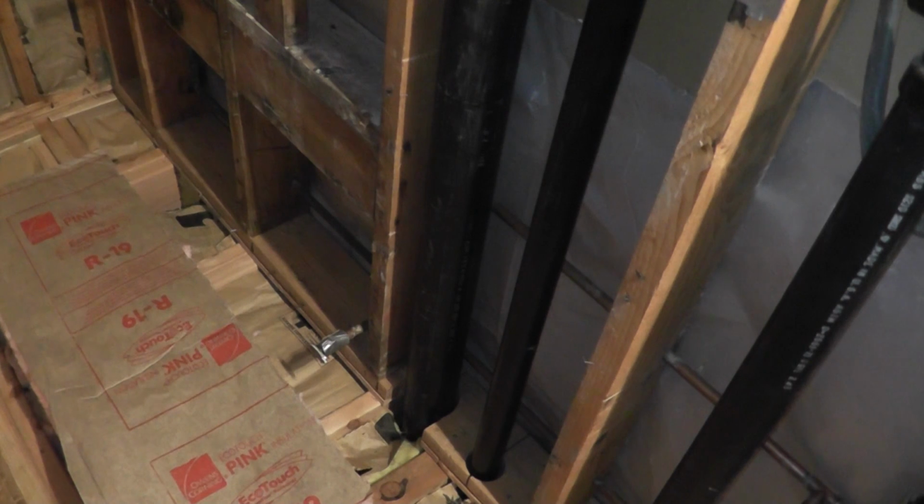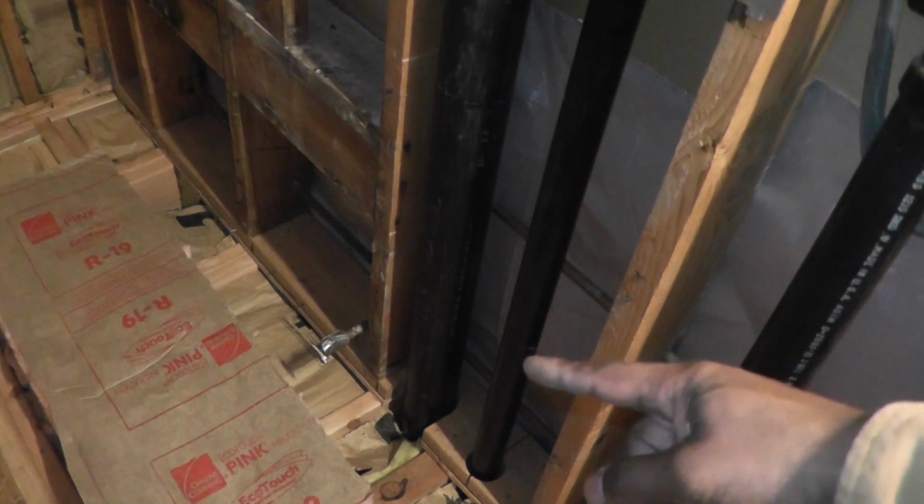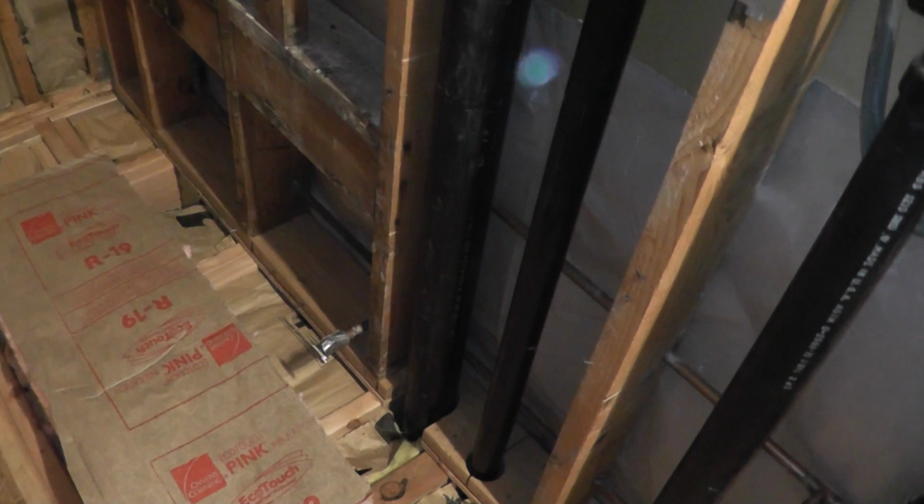Along the back side also, when it contracted, it would rub up against the sole plate, actually it wasn't the sole plate, it was more the subfloor underneath it, because the subfloor extends a little bit more into the hole that I cut than it should. So what I had to do was go underneath the floor with a chisel and chisel that out. So I've got pretty good spacing around there now. I shouldn't have any issues with any rubbing or any sounds around that pipe.